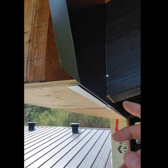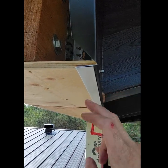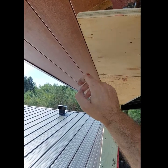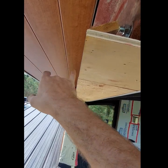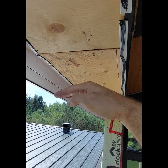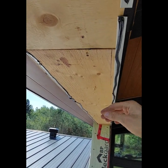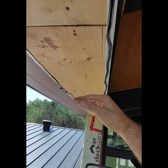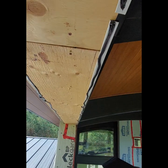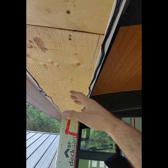Along the bottom of this piece I did a groove and the next piece is going to clip onto this section. I'll put a bead of caulking on the tab — next piece slides in, goes back down, goes underneath. I'll have another bead of caulking there as well, it'll fold up with another tab, and the third piece goes straight up from that. Both sides are caulked ready for the other piece. I prefer two beads of caulking along the edges wherever there's a bend — putting some in the middle usually shows oil canning. By keeping it along the ridges where there's more rigidity, the middle can bow more smoothly.